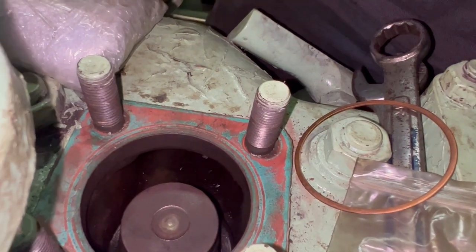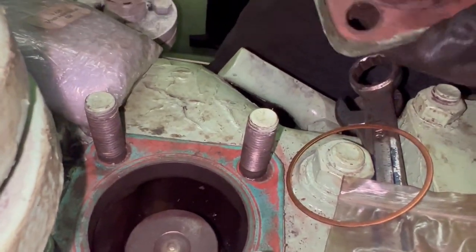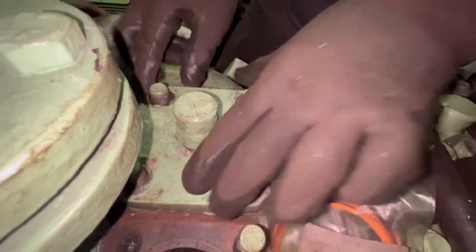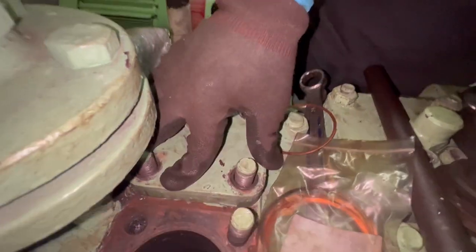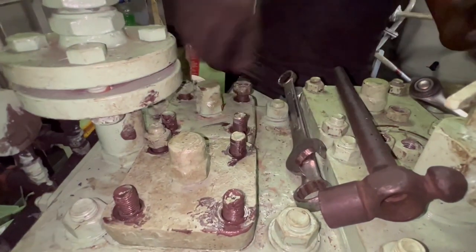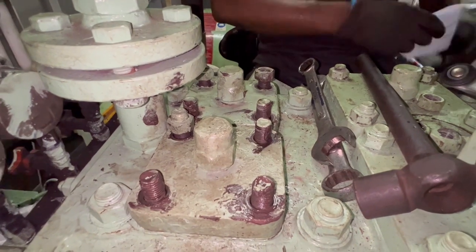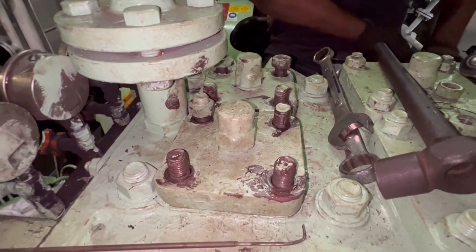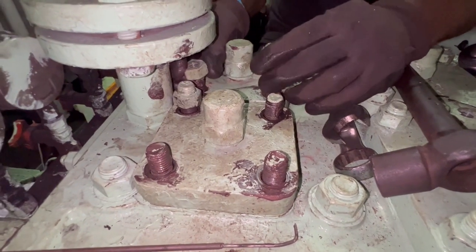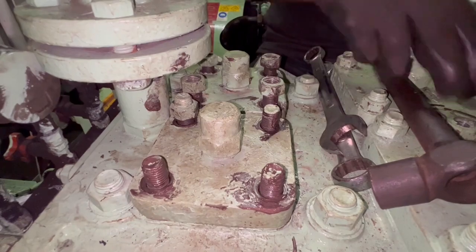After fitting the cover, put back the flange cover in place. Check that the cover is okay and all is fine. Put back the nut and fit it back. Regarding the tightening of the nuts — for all compressors, whatever make, you can find the torque tightening value for the particular nuts in the manual.